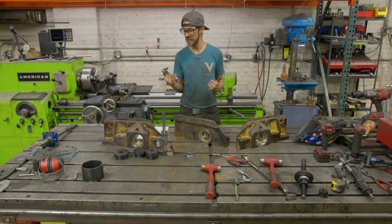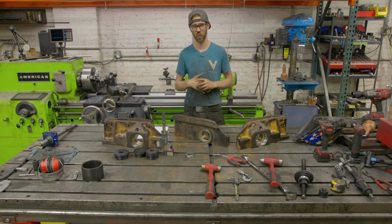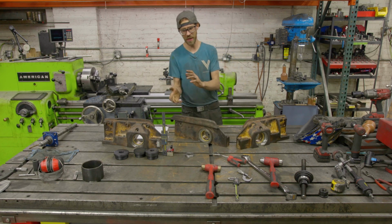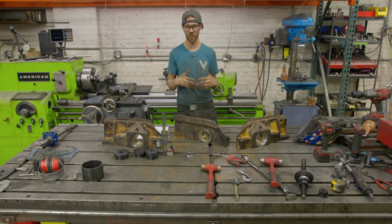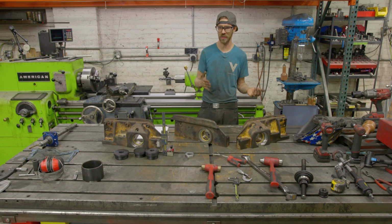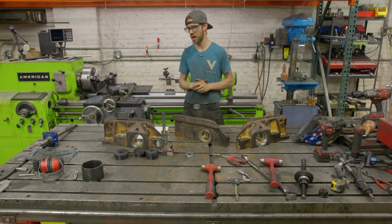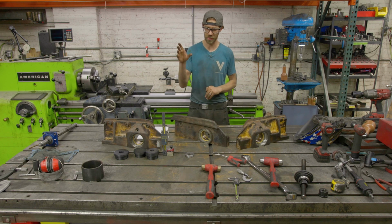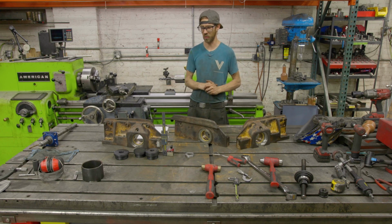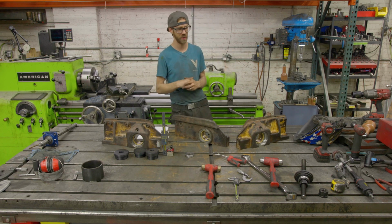That worked pretty well, but the reality is this style of measuring works really well as a reference measurement, meaning you can measure the bar, measure off the base and all that, but really it's best to take a cut, measure it, and sort of advance the tool based on that, because there's going to be deflection in the bar and all these variables. And so insert wear, by doing it as a reference measurement, works pretty well, and this works well for that, which is a win.